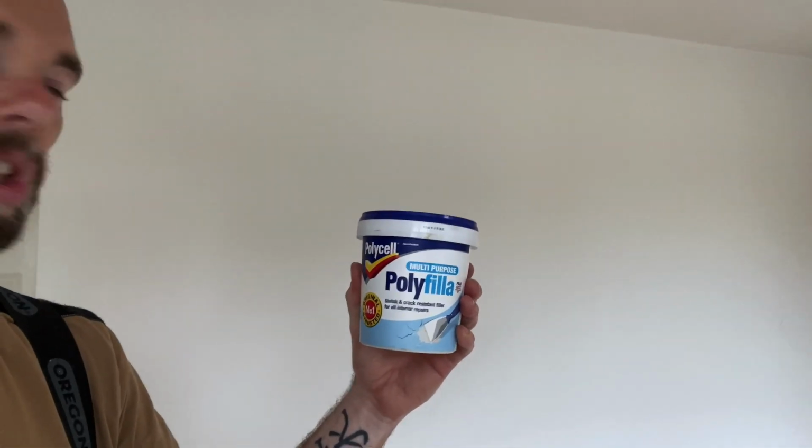One of the things that I've been finding lately, which is really quite cool, is this pre-knocked up stuff. It used to be terrible years ago. You'd get stuff called, was it Red Devil or something like that? And Sparkers used to love it. Literally they'd do a chase and just whack their stuff in it and not really give it a very good finish, but it's as hard as cement. Trying to rub it down was a pain. But this stuff is much better now. You get it from all different brands, and it's great for these little baby repairs. Absolutely perfect, and it rubs down a treat. So it definitely gets the thumbs up.